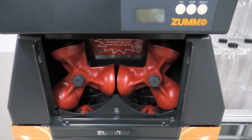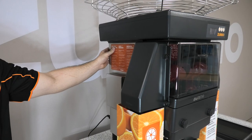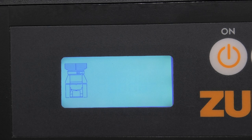To diagnose, we will need to unblock the jam and then remove the front cover to check the colour and measurements of the cups and domes. To unblock a jam when the cups are in their downward position, first switch the machine off from the back and then turn it back on. Often times this resolves the jam.